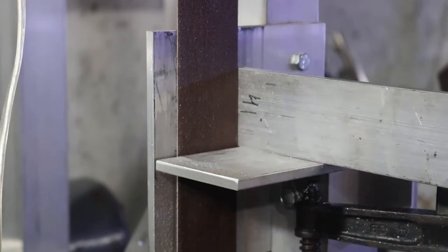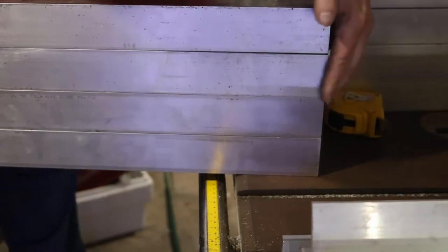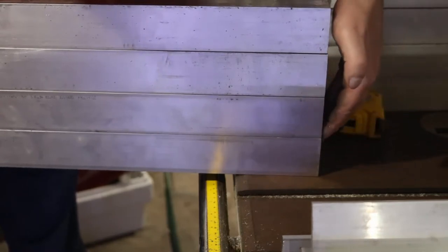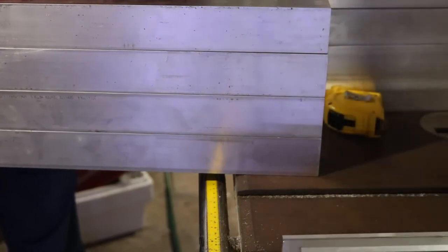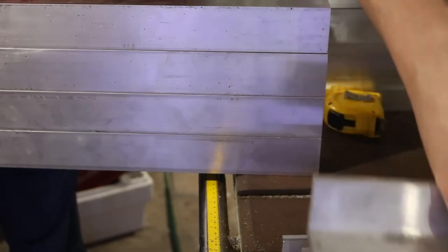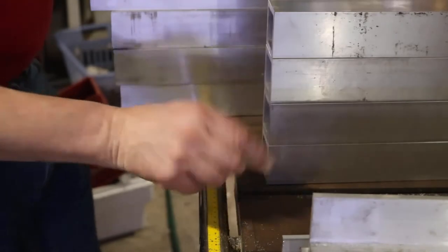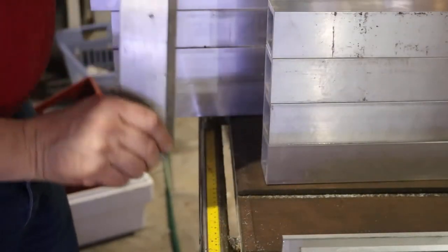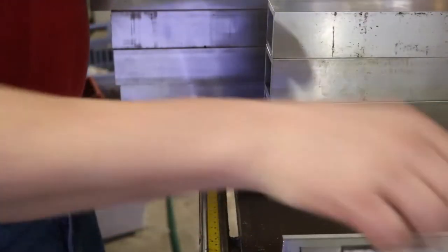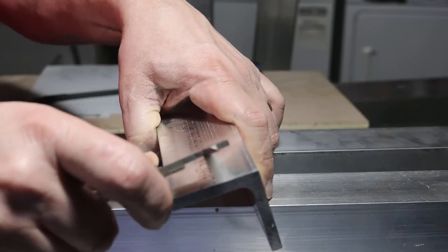What I have to do with each piece is what I'm doing here: I took a piece of angle, clamped it to 90 degrees to the post, and each piece has to be sanded so they have a nice square bottom. More importantly, they all have to be sanded so they are exactly the same length. By exact, I mean within a sixteenth - preferably a thirty-second. I've finished the whole build so I know what it looks like. Here are the first four legs, sanded down, and I'm going to stack them and pull up a piece of angle as a straight edge.